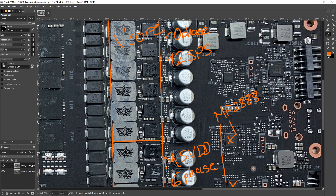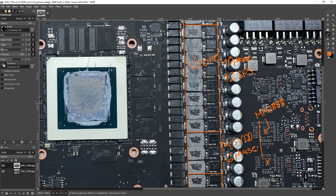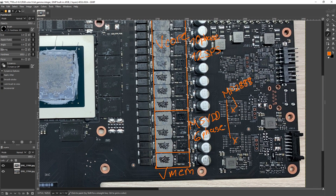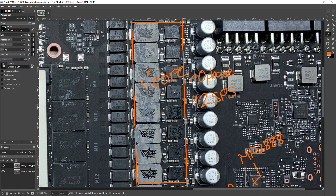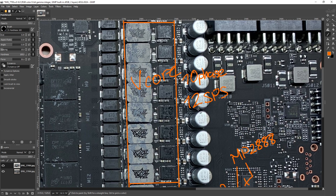That's a really great controller — should be super fast in terms of dealing with transients. Unfortunately the only way to confirm that is if you had a card and hooked up an oscilloscope so you could compare it against other cards. At that point you also have to factor in the capacitor configuration, the inductor configuration, and potentially the programming of the actual voltage controller, because just because you're using a high-end voltage controller doesn't mean you can't configure it incorrectly. But hardware-wise, as far as controller choices go, this is as good as it basically gets for 30 series cards.